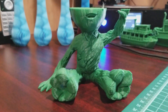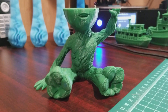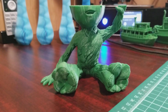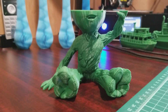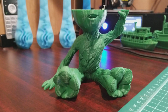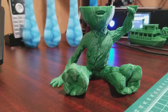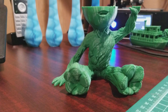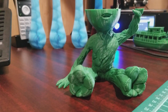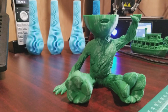So the Groot — we had a power failure, and this printer advertises power failure resume. The ability to resume a print from a power failure, and sure enough we had one. I hit the button because I'm printing from SD, not OctoPrint, and it was able to resume. The problem was I still had OctoPi hooked up, and Delta printers with Arduino 8-bit boards don't do too well with OctoPi. OctoPi is polling the board too often, and between all the calculations the Arduino board has to do for the trig on a Delta, it can't keep up with both the USB and the calculations. It was responding back over USB, freezing, and just stops printing when you try to use OctoPrint.